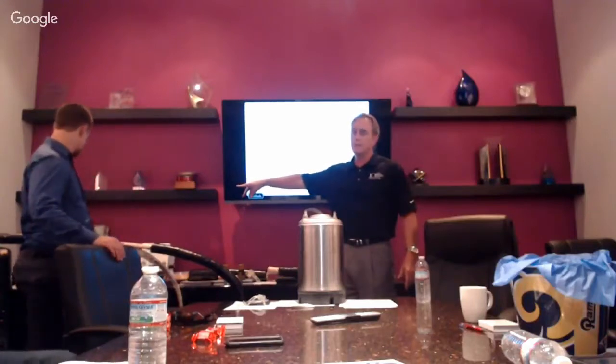Well, this particular customer was doing 2 of them, and they had 4 towers. So they're doing 8. Well, let me tell you, 8 is 8 more regulators. I guess you could probably split them. Just if you had ordered a draft system, that's not what you're getting. Right, so we would have to get 8 regulators, set up 8 systems to do 8 kegs at once so that they could have them ready in the 4 stations, 2 at each station. Walk-ins are only made so big. And, you know, the 4 of those panels, we said about 14 inches times 4. Most of the time, there isn't that much real estate on the walls. And that's just an, oh, by the way, we're going to do these craft cocktails that we've got to force carbonate.